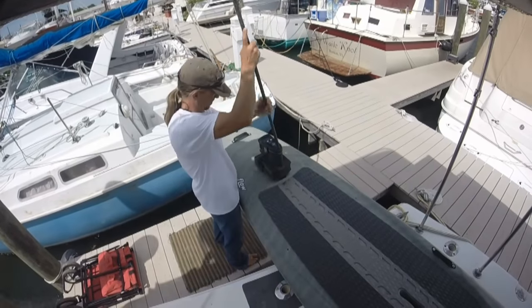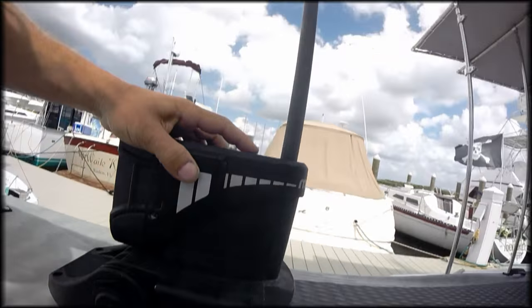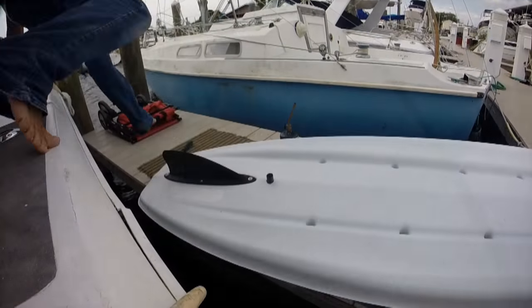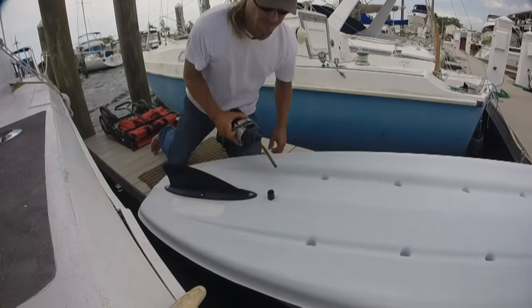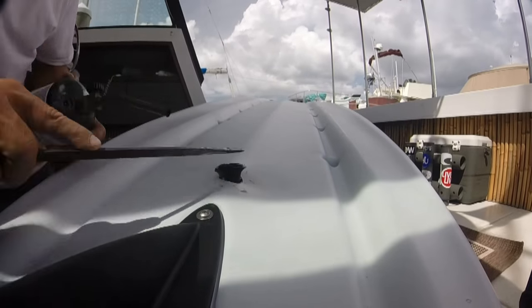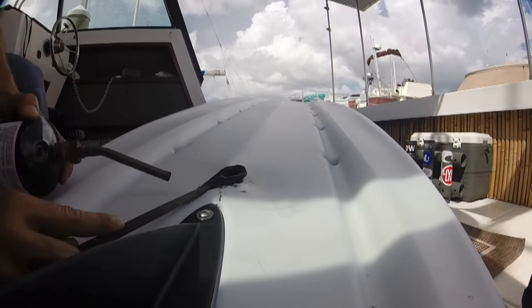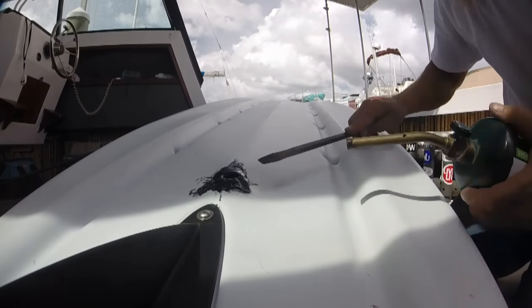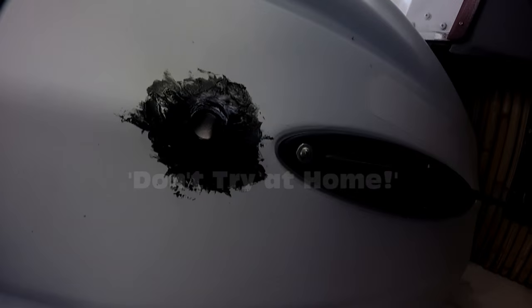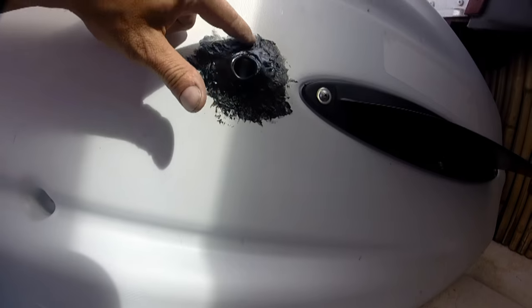Here you can see I'm fitting the spike to make sure it passes through cleanly, and it does. Now I'm ready to melt the bottom side. You've got to heat the plastic of the paddleboard about the same as the plastic of the pipe and they will melt together and become waterproof. However, this will void your warranty, so don't do this to your brand-new paddleboards or kayaks — this is a project where I'd say don't try at home. There you go — one scupper hole made to order. Not pretty, but that's the bottom and you're not really going to see that.